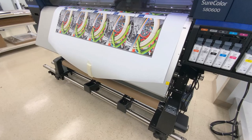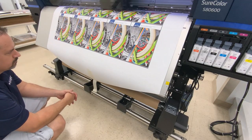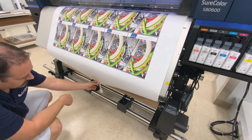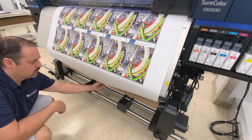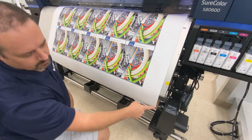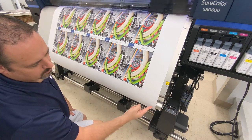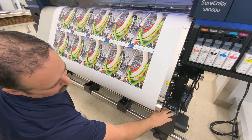Back the material up using the up arrow button on the machine so that the beginning of the tape is just after the print zone window. Send the job to print. Once the material is in position to attach the take-up, apply even pressure from the middle and tape the product to the empty core. Then pull the dancer bar handle towards you. Flip the switch down to wind the print side out, or up to wind the print side in.